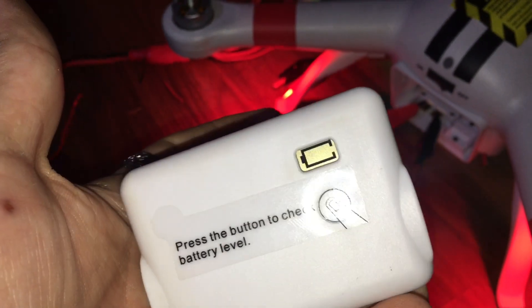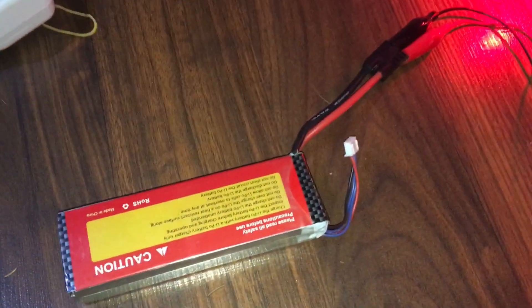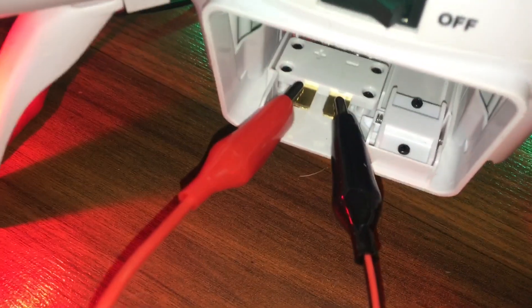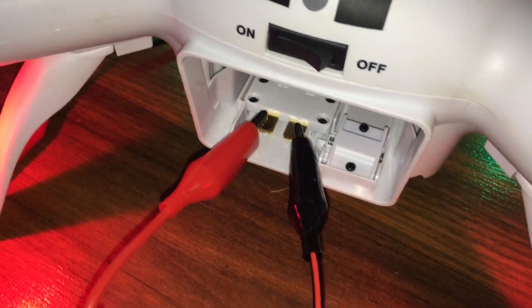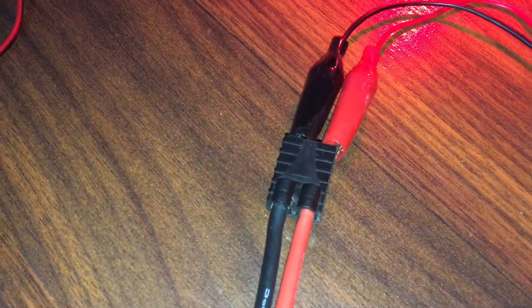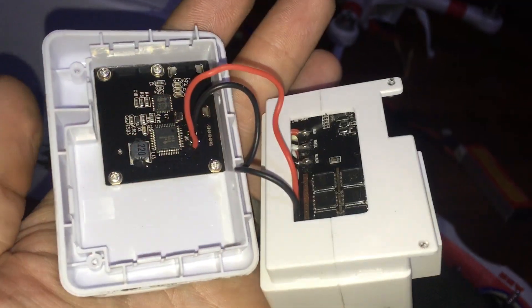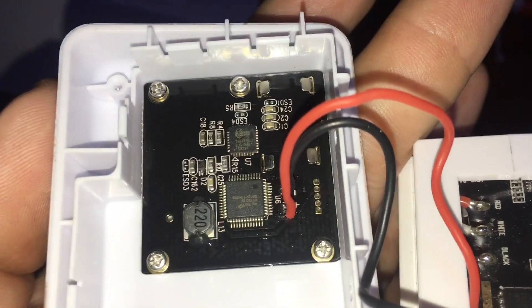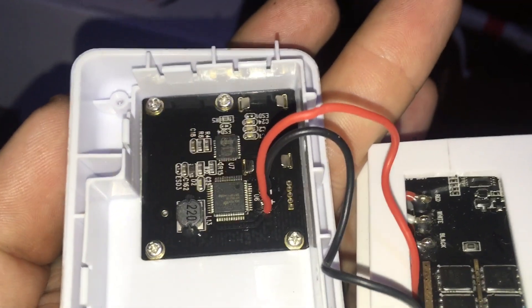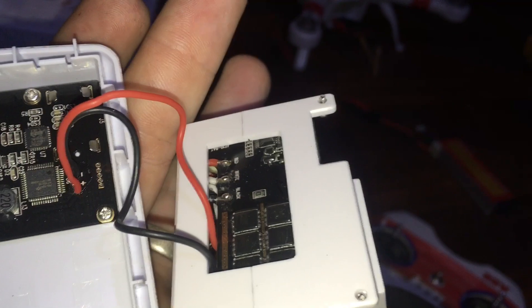Otherwise we can just use batteries like this and be able to run the drone rather than not running it at all. I'm going to pull this apart and see if I can make it compatible with the connector teeth. If I had to mod it, it would be simple — just solder to the positive and negative with an XT60 connection or something like a Traxxas connection, then just plug and play. Also note: this is not a smart battery. They make it look like one because of the LCD display, but that's all it is — just positive and negative going to an LCD. DJI batteries are smart and they don't bloat like this.